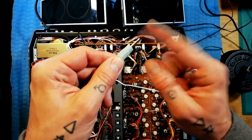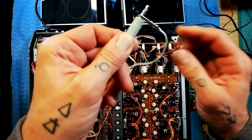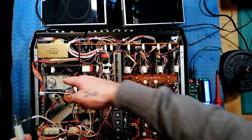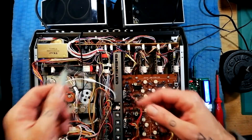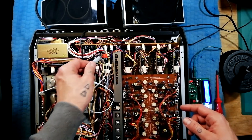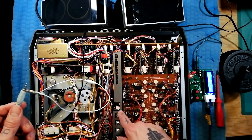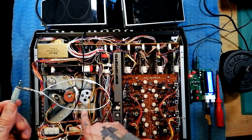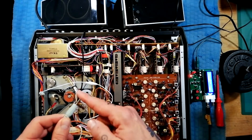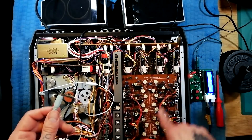One speaker, the other speaker, and ground at the bottom. I've got a crocodile clip going from the ground pin — attached to the metal part of the cassette housing, which is connected to ground. I need to be reasonably careful not to touch any DC current just in case it does something bad to the speakers. I'm injecting a sine wave where the tape input would go, and I'll explain why I'm using that rather than just a tape in a second. I can then touch this against various pins through the system to establish how far the signal is getting.